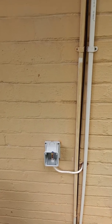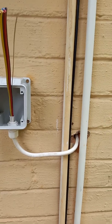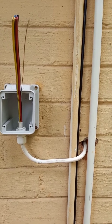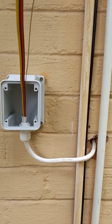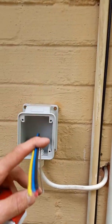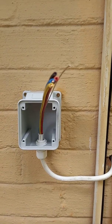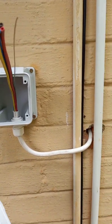Welcome back. I've now put the socket on the wall. I had to drill through the wall, and unfortunately it's in the corner inside, but it came through between the pipes on the outside, so there's not much I can do there. I'll have to plaster and paint there and then just secure that down. You can see here we have our three phases, neutral, and earth cable — these are the South African colors: red, yellow, blue, black for neutral, and the earth. And here is the socket.